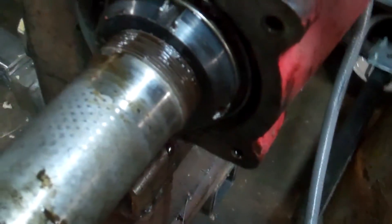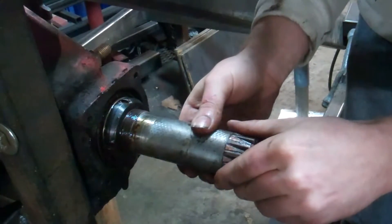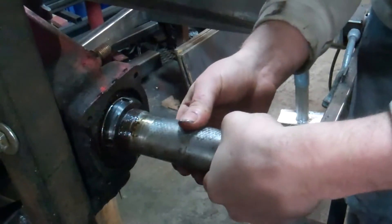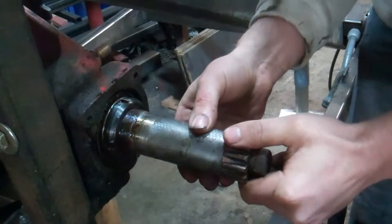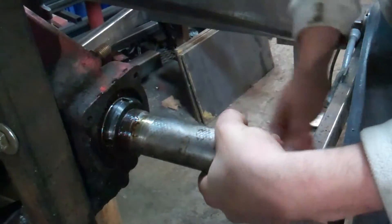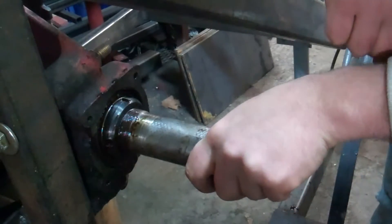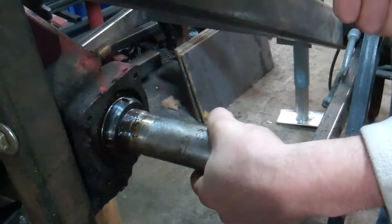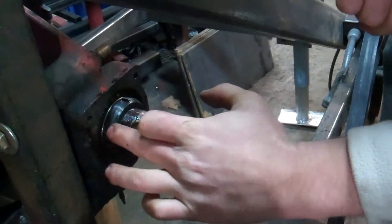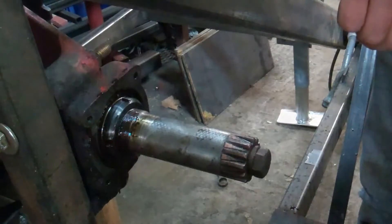While it's loose, you have about that much motion. But once you tighten it up, there is no motion. The same goes for up and down motion — once you tighten it, there's no up and down, no side to side. So this is some sort of tapered bearing — tapered roller bearing is what I'm guessing. If we can just tighten this down some more, that would be great. I'm having trouble getting this guy to turn, so interested in y'all's thoughts, and this is where I'm at with it.